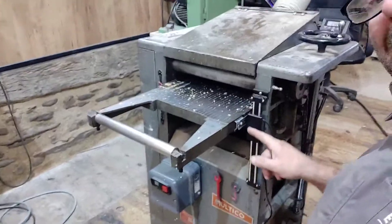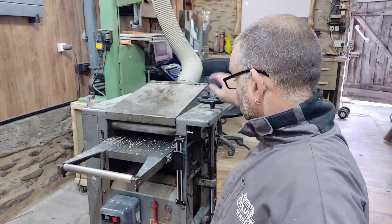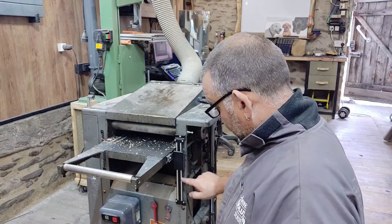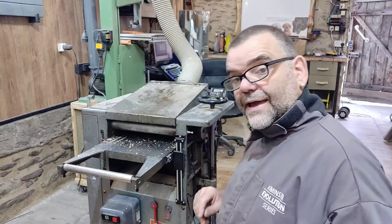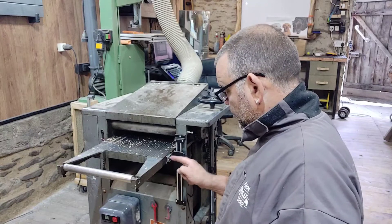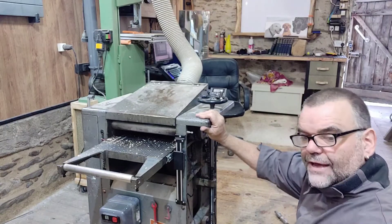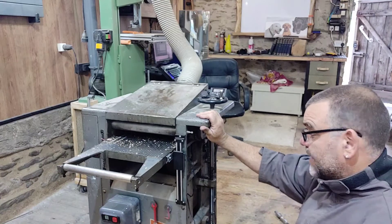I then remove the screw that fixes it to the table and move the device up to that pencil mark line. Then I come up to the display and press zero — that marks it as zero, calibrating it to nothing at all. Once I've done that, I bring the table back down and re-fix the screw so the table is attached again. The difference from zero to wherever it comes down to becomes the measurement — the distance between table and cutter block. There's a slot on the screw for a little fine increment, but on the whole it's near enough. It's just a visual gauge, and for everything else I use the verniers anyway.